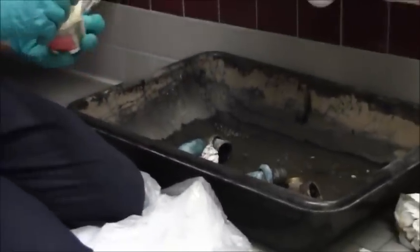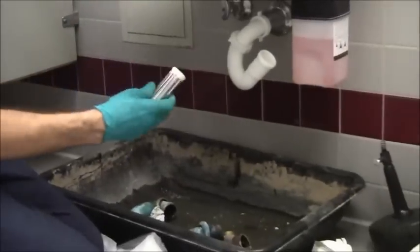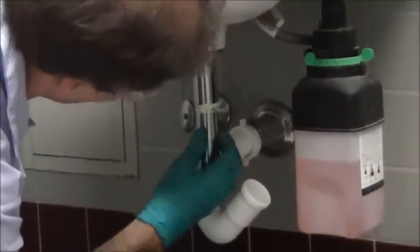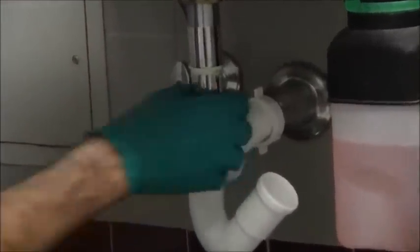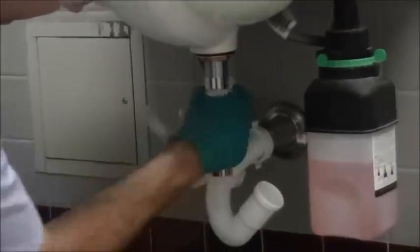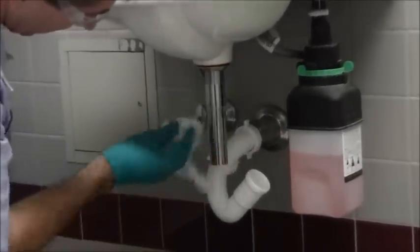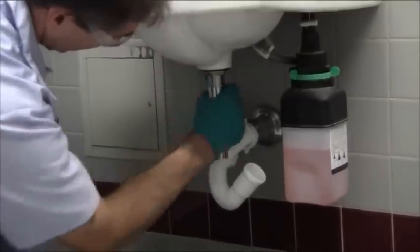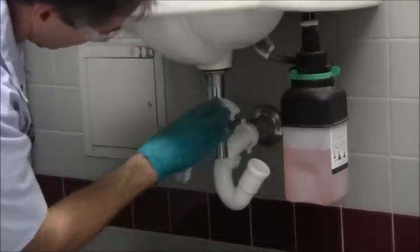And when I screw this in, I'm also going to hold with my needle nose pliers because I don't want to disturb my basket at all. Even though it was pretty tight, I still don't want to take any chances there. Okay, that's pretty tight. Now, I can just take this just to clean that off so that that's nice and clean. Now that gives me a nice tailpiece to attach to.